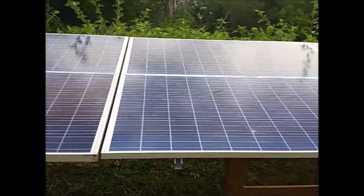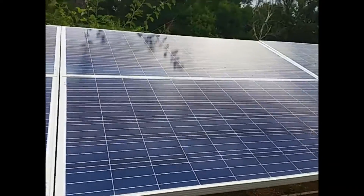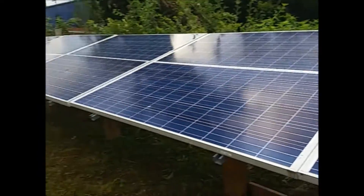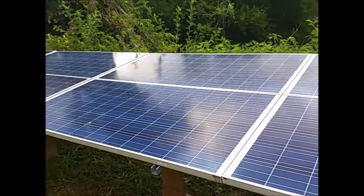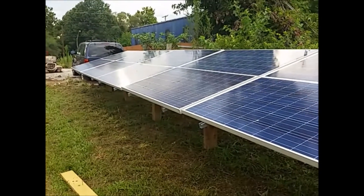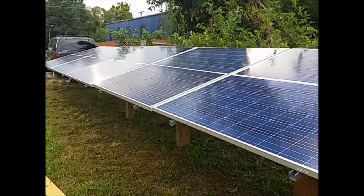The downside is they're passively cooled. On warm days, even though they're underneath the panels and shielded from direct sunlight, they do kick off every once in a while when they hit a temperature threshold — and then you're not making power.